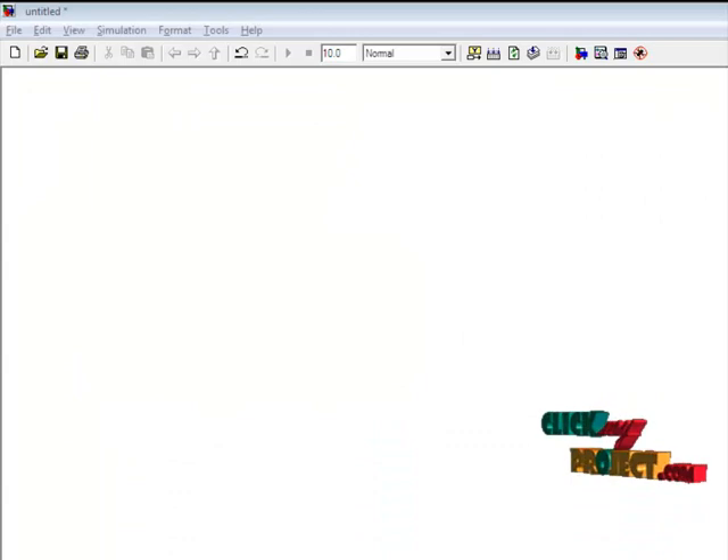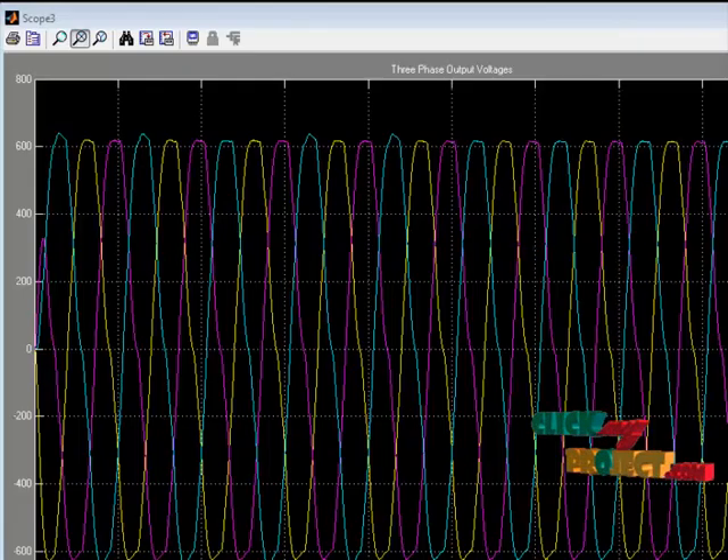Now we see the running process. Our product is simulated in MATLAB 2009b. First, open the MATLAB window, then open a new model window — this is the working window where all design data are entered. In our product there are 18 MOSFET switches, 2 flying capacitors, and 2 diodes in each phase. Each phase has 6 modes of operation, and all modes of operation are common for all phases. In each mode of operation, only 3 switches are turned on.